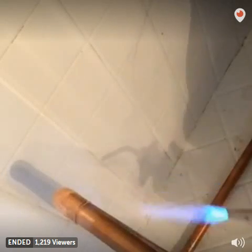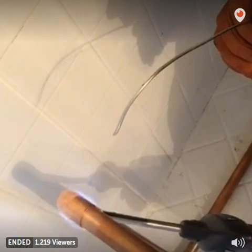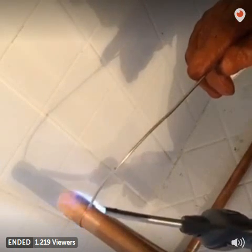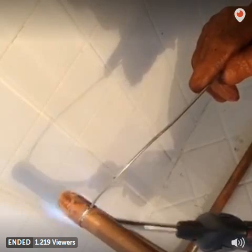I don't have any goggles, so I'm just gonna have to play it safe — as safe as one can. Two dudes in the shower sweating pipe — sounds dirty. Well, thankfully there's only one dude in a shower sweating pipe. We're gonna heat it where you want the solder to go. I'm not going to get arc burn because I'm not arc welding — I'm using gas, not electricity, and the light ain't that bright. It's gonna be fine. Not the ideal way to do this but it'll totally work — I promise. See, that right there, that's it working.